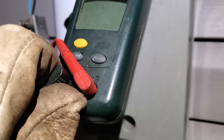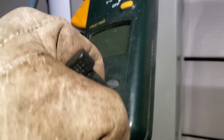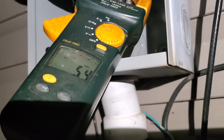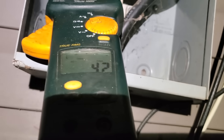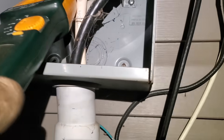Something else I want to add: the more off-balance the load is, the more those bad voltages are going to show themselves. If you're not getting a clear indication right off the bat that the neutral is bad, get the customer to pop their microwave or a toaster on. A microwave is going to draw 15 amps. Right now this hot we're drawing 5.3 amps and this side 4 amps — it's almost a perfectly balanced load, only off by an amp or two on each side.